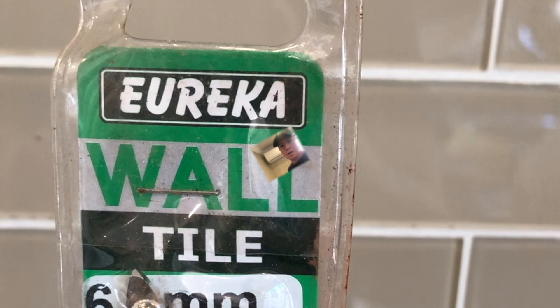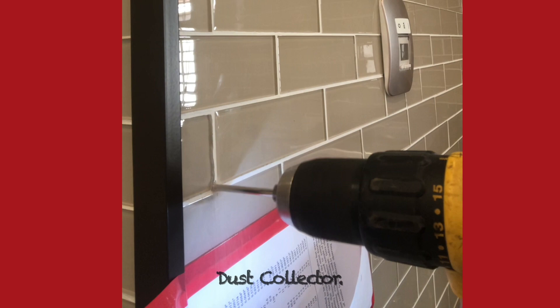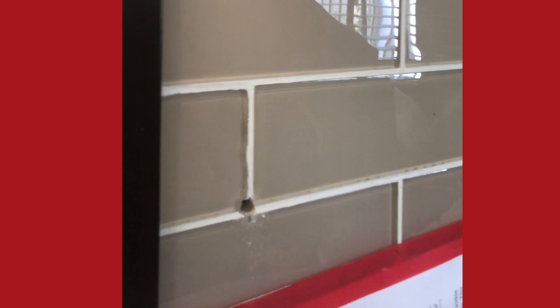I'm going to start off my drilling process with the glass bit, just to get through the cladding of the mosaics. I'm not going to be pushing too hard — I'm just going to try and cut the glass. As you can see, the drill bit does an amazing job; it just neatly cuts a nice hole in the glass without cracking. Now once I'm through that, I will go through with a masonry bit on hammer mode.